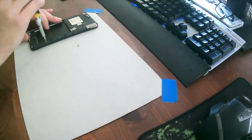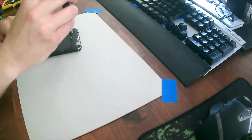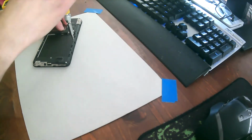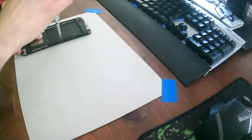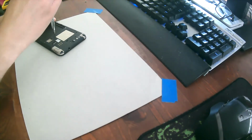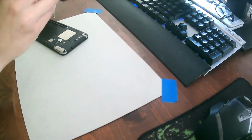Yeah, so I've already done this to 3 other phones, and it was surprisingly easy. What you need to do after you're finished with removing these components is you run the factory image made by Martin for the factory, as the name entails, and as you run the automated tests, it flashes ANX, and then you're pretty much done, and it just works. You can connect peripherals to your PinePhone, or you can get HDMI out in those kernels which have that enabled, so those images which run kernel 5.7 and what have you.